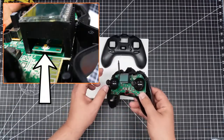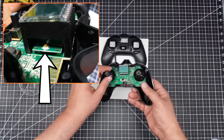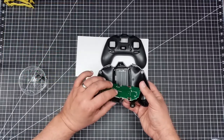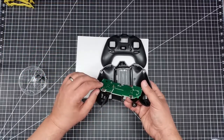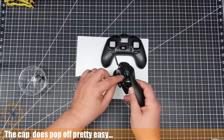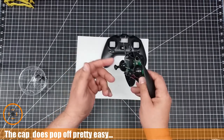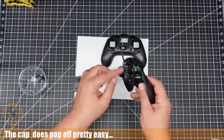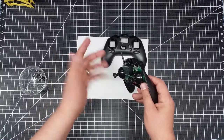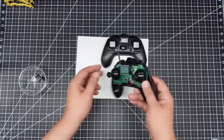This is where it gets a little tricky, because the transmitter is under the LCD screen, and the LCD screen is soldered into the board. So getting this off will be, you know, not something for the faint of heart. However, I think I can take a small screwdriver, pop this micro cap off, and if I get another micro cap connector type antenna, I'll be able to attach it and I'll be good. I'm going to order one off Amazon and see if I can do that — if I can, I think I'll be golden.